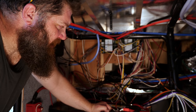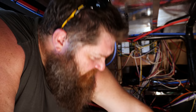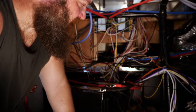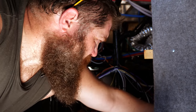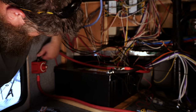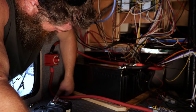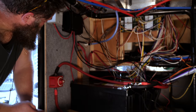Let's go ahead and check all the connections. It's always best to have someone else come in behind you to check your connections and make sure everything's tight — sometimes you find something that may be loose. I want to make sure I can't pull anything off. Right there — look. Some high amperage through there would mean some serious heat. That's the worst thing we can do. We need to tighten that up.